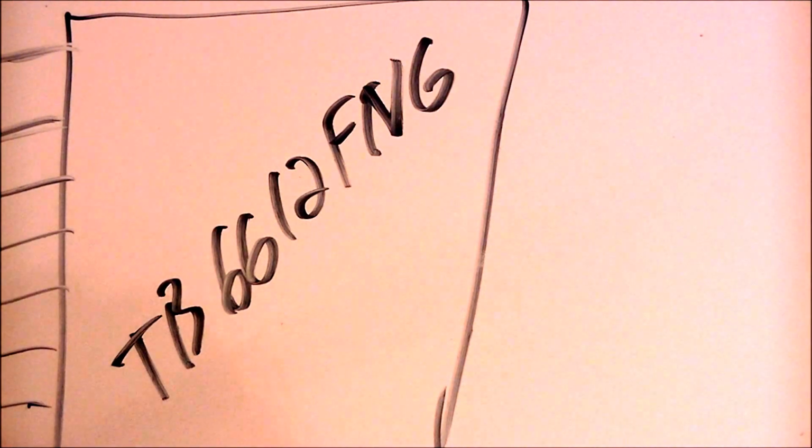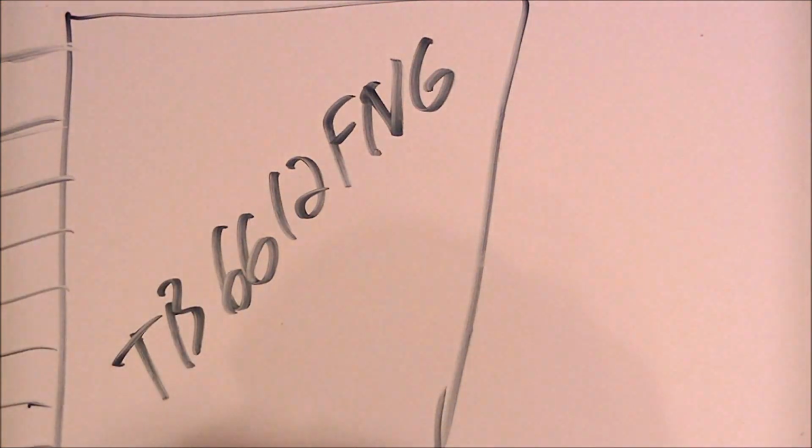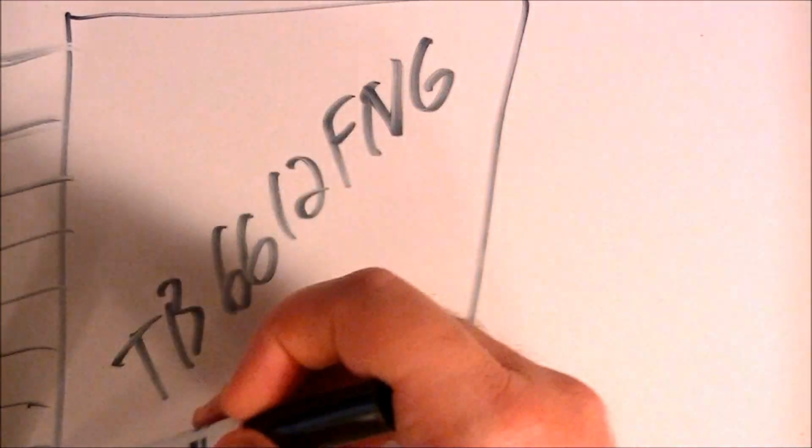And then okay, VMOT. That's going to go to the positive of the battery pack. And then ground, we're going to hook that up to the ground of the battery pack. Although really, since it's all going to be on one common ground anyway, you could just tie this ground in with this one and it might be at the same potential anyway.